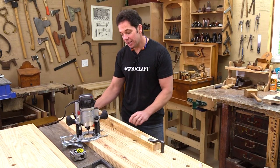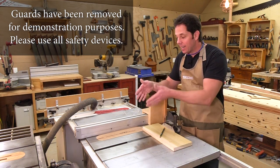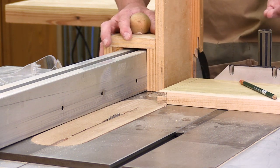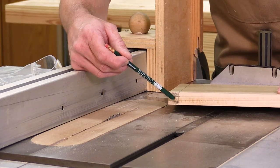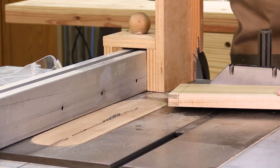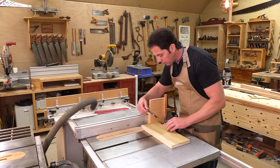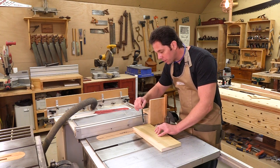So there are a couple of ways to make your mortises. Now let me show you how to do some tenons. The way I like to make my tenons is on the table saw. I'm going to demonstrate this using a single blade and a homemade tenon jig I've made out of some scrap wood. There are two cuts to make this tenon — I first want to make my shoulder cut and then I'll reset it to make the cheek cut. I'm using my tenon jig as a standoff, and with the miter gauge I'm holding it at a true 90 degrees, which allows no resistance between the workpiece and the fence. This makes it a lot safer for the cut.